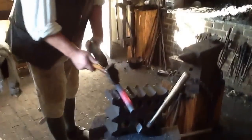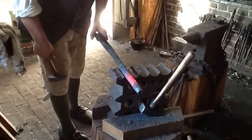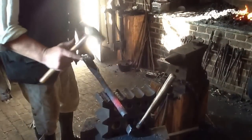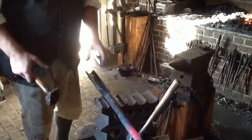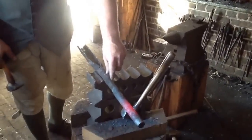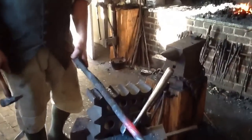Welded. It's a hump out there. You might have to jump some back into there. At least I know how to do it. Yep, that's how you do it. You just isolate it, and make sure you put the heat on that spot, and make sure you put it on wide enough. Make it too narrow and not as much moves. But if you put it in when it's cold, and you know you need to go there, it makes it do what you want it to do.